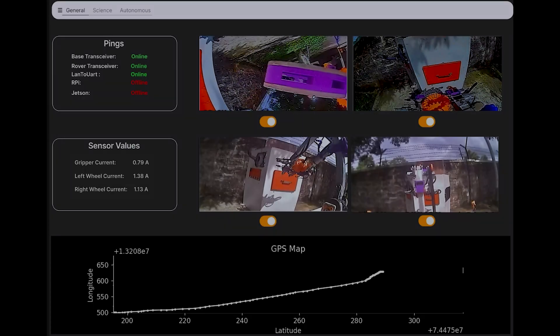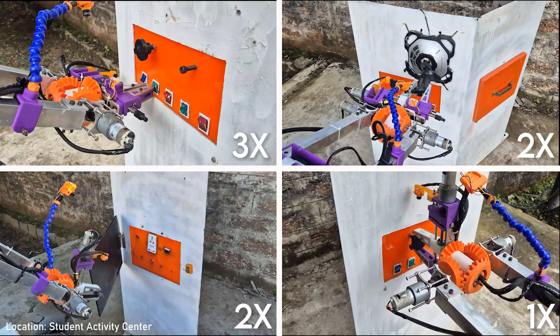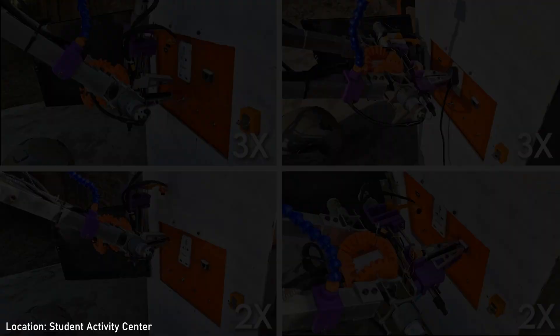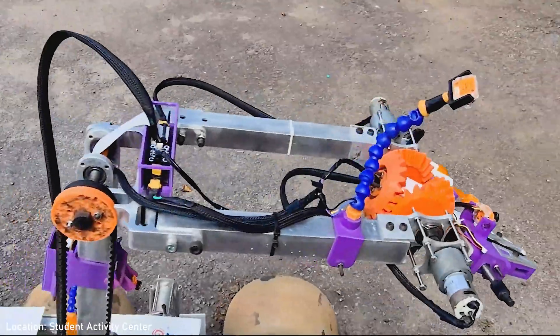For the instrument deployment and maintenance operation, we have redesigned our GUI to enable intuitive navigation. A new single-action parallel gripper activated by a lead screw drive, coupled with a custom 3D-printed bevel gear differential, has been implemented to ensure accurate task performance and enables picking and placing of objects up to 5 kg. The driver can seamlessly switch between forward and inverse kinematics during the mission.